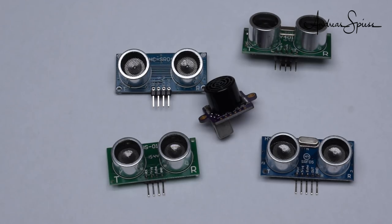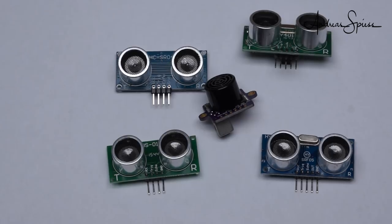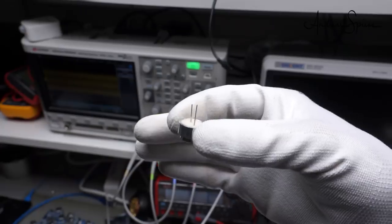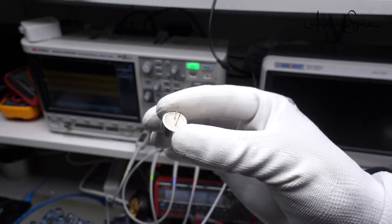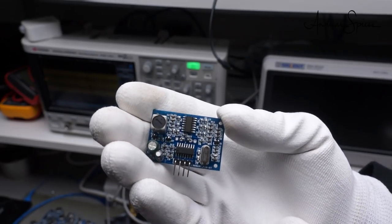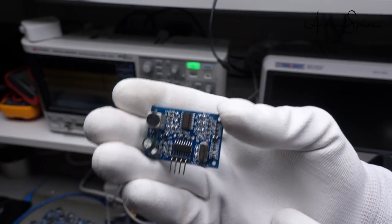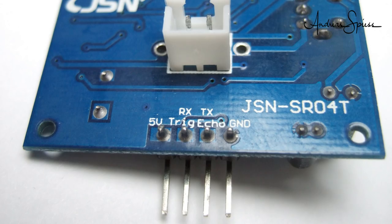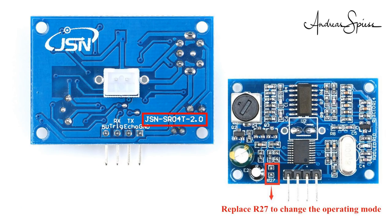All sensors so far were strictly for indoor use because they are not water resistant. The next one is made for car parking sensors and therefore has to be water resistant. It consists of a sensor that seems to be completely sealed, with the electronics board connected via a long cable that can be mounted at a dry place. This sensor has a typical trigger/echo interface and I connect it the same way as the SRF05. The pins are also labeled RX/TX but I did not find out how to switch into serial mode. The newer sensors labeled 2.0 should be 3.3V compatible, and you find more information in the datasheet on how to switch to serial mode — a link is in the description.